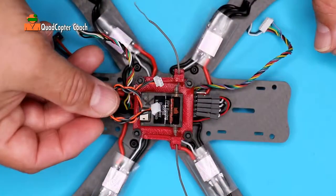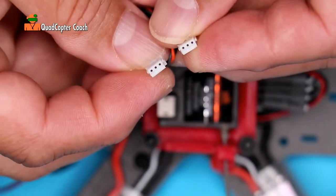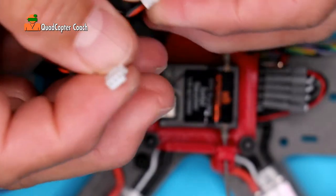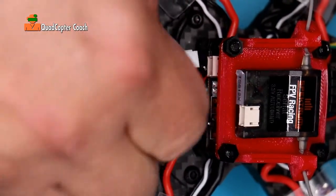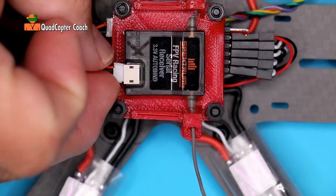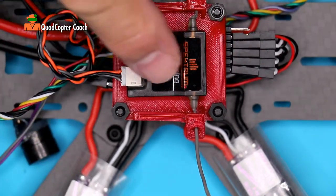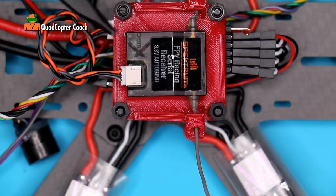Take your spectrum wire connectors. The connectors have three holes that are closer to the top edge. With the holes closest to the top edge, find the spectrum connector that you put on your flight controller and just plug it in, just like that. Take the other connector with the holes closest to the top edge and slide it into your spectrum receiver, just like that. You may want to also give it a little push down to make sure that the adhesive is holding in place. Your spectrum radio receiver is now connected to your flight controller.